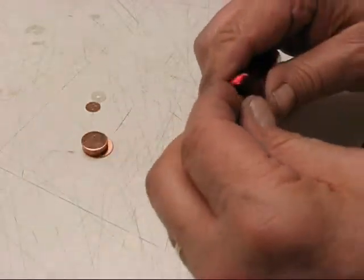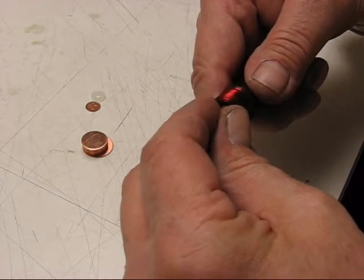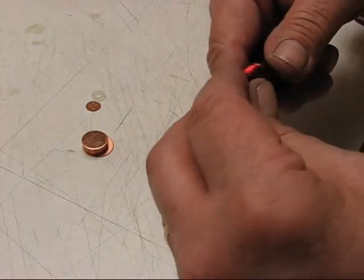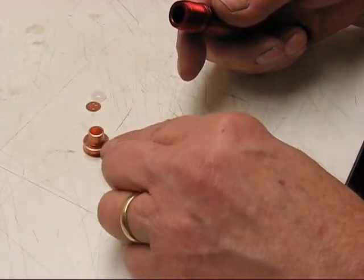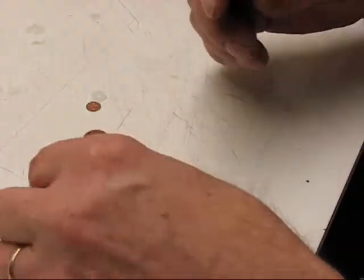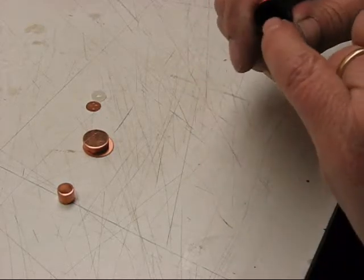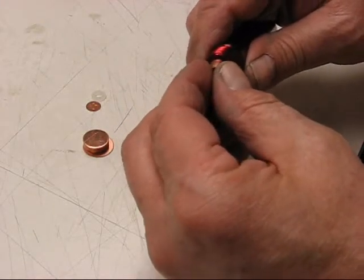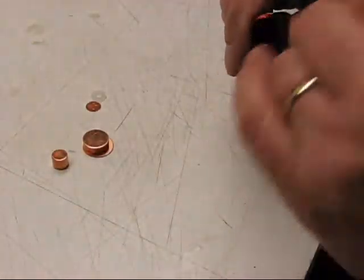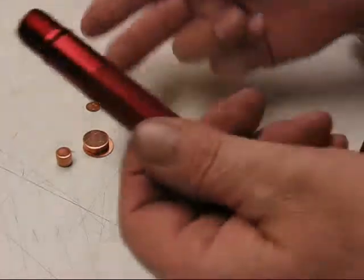The other thing I've done is I'm a lot closer now with that copper touching the inside of that body. I do these by eye when I solder them, so I could be off a little bit. What I do is I open that body up with a round file — I just take and open that center opening up to give me a little bit more room, a little more play — so I don't have any problem with that copper touching in the center and causing the light to turn on even though you haven't twisted the head.